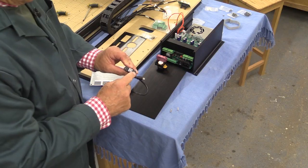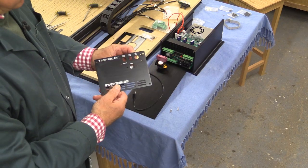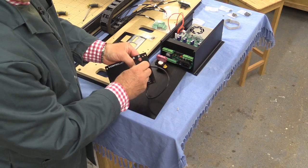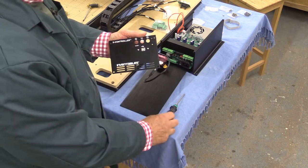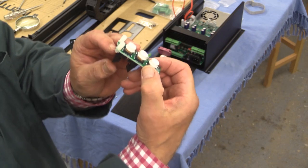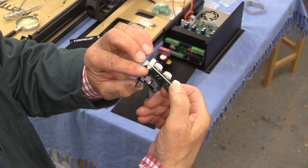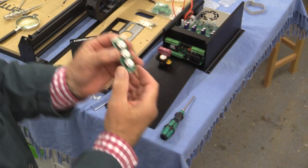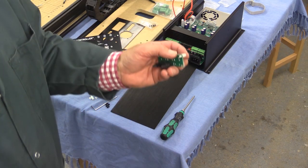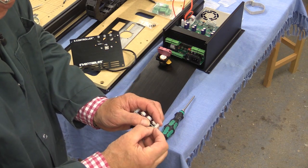Next, we've removed the little screws from the USB cable. We've taken this piece and we're going to screw the USB cable into position, then screw those up — that's nice and tight. Next, we're going to take this button PCB and fit these nylon standoffs. There's a piece that stands up like that, and on the other end there's a little nut, and they're made of white plastic. Now, whatever you do, if you're doing this in your workshop, don't drop any of these bits on the floor, because you might never find them.